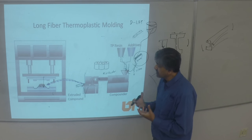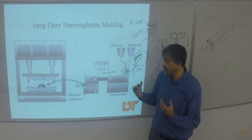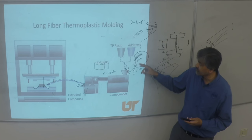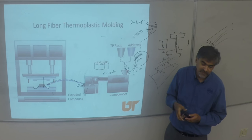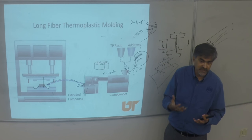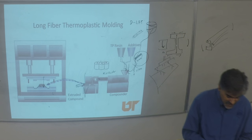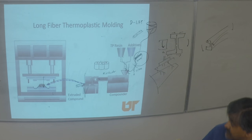With DLFT, the material is plasticized continuously and fed directly to the robot, eliminating the hot-melt impregnation pellet step. Companies like Owens Corning or PPG send rolls of fiber; they're pulled directly into the extruder and continuously processed. This dramatically reduces cycle times. Currently it's growing rapidly — limited to olefins, but now being extended to nylons and other crystalline materials, though wetting out heavier engineered polymers remains a technical challenge.